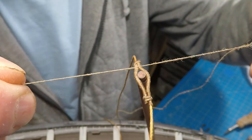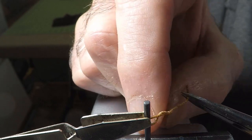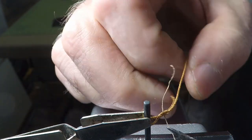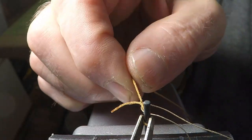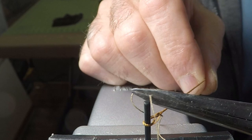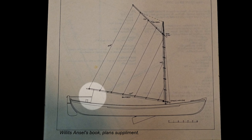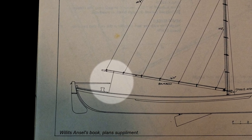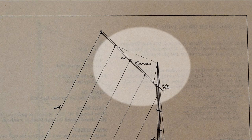At the other end, there was sometimes a thimble turned into an eye splice; other times, just a naked splice. The lanyard needed to secure the shroud to the boat was also spliced into that. The sheet was just a five-eighths inch piece of line spliced or tied onto the boom at a point where the boat header or the mate could control it easily — no blocks, no pulleys, just a rope.